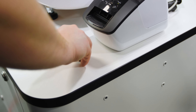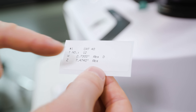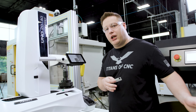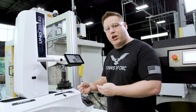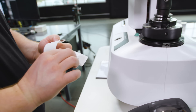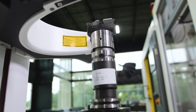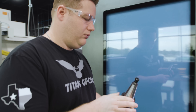On this label you can see it's got our adapter called out — CAT40 — our tool number, our diameter, and our length. One of the great things about having a tool presetter is if your machine is running one job, you can have your tool cart over here with as many tools as you want for your next job, teaching the length and sticking these labels on every tool. That way it's completely ready to go. When that job is complete you roll it over, put all your tools in, and just insert the numbers into your offsets. So now we've got the tool set — it's time to put it in the machine and insert our offset.